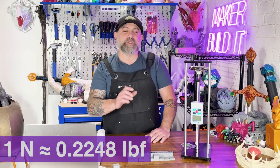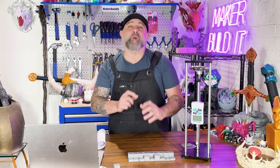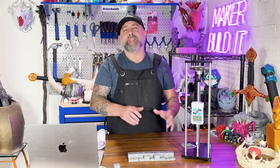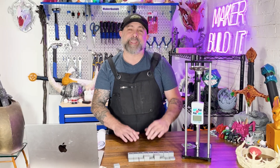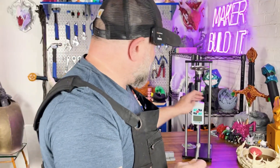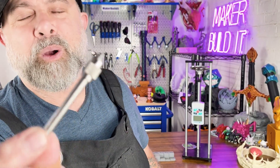We're also going to look at the metrics per cube, including filament in grams and the amount of time it took to print. Then we'll figure out how many newtons of force it takes to puncture a hole in each one. We're using rectilinear infill — I think of infill like pizza toppings. Some people like it at 20%, and some go to 90% and will judge you if you don't use gyroid. We'll use our force meter and probe to measure penetration in newtons.